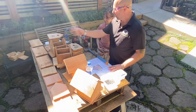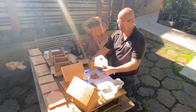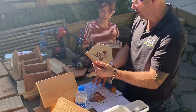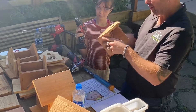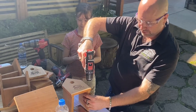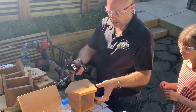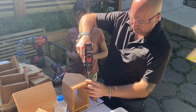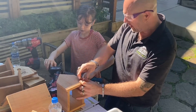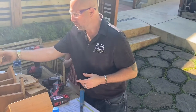So step one, we have to find the pieces, and we need to secure the front to the sides. It's important when you put these in — I like to have a little bit of a lip here, and you bring it up a little bit for venting. Samaria, you're already done. She already got it together. Typically we pre-drill the hole right through here. On the back side we go like this, line it up, pre-drill the hole, and there's going to be four of them. Then we get a nail, pop it in there, and nail it in. That's step one.